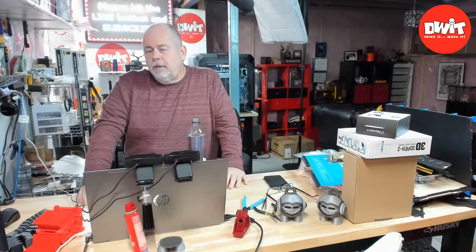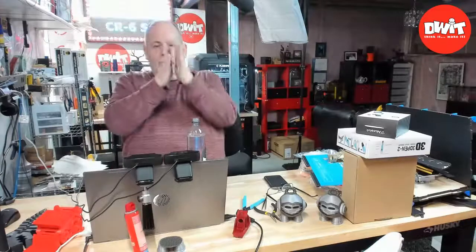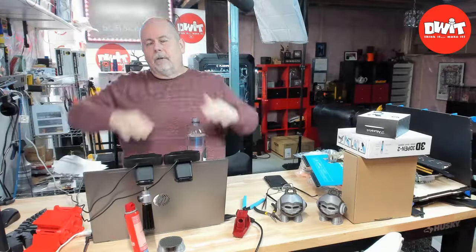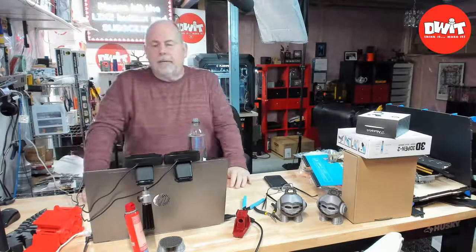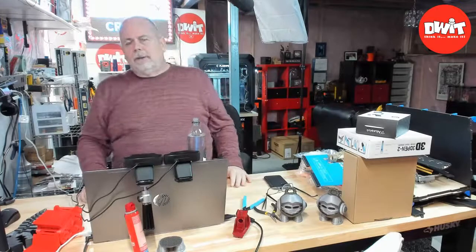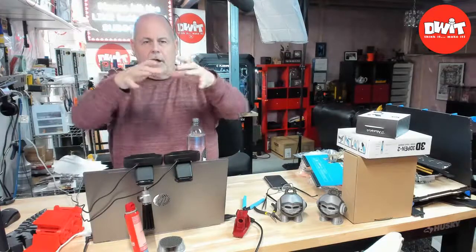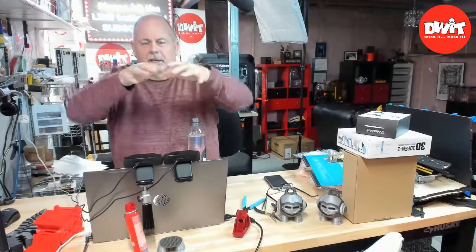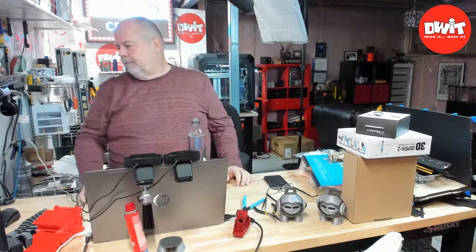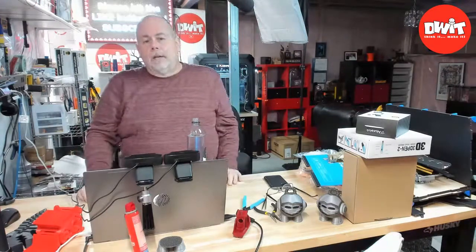Yeah, the brims should stick together. If you're doing a brim and you're getting separate lines, like your brim's lines are not meeting, then you definitely need to go lower on your nozzle. You need to lower that z-axis for sure. Your nozzle definitely needs to be closer because a brim should stick together. The idea of a brim is that it comes up and touches your model and basically glues it in place. And if your filament's not sticking together on your brim, it's going to allow for some wiggle room. So there's a clue there for sure that you need to lower that nozzle a little bit.